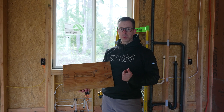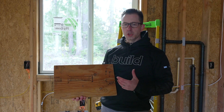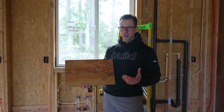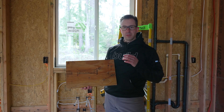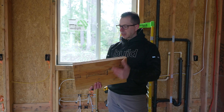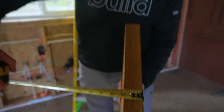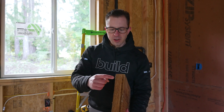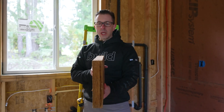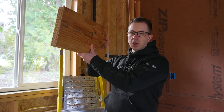Here's a different option and this is what we subscribe to. This is an LVL header — laminated veneer lumber — from Roseburg Company. In the future we'll talk about engineered wood products, but that's what this is: an EWP, engineered wood product. It has been manufactured by a different process and it is very strong and dimensionally stable. It's so strong that instead of being say a 4x8 member, look at how thin this is. If we just run a tape on it, it's about an inch and three quarters. If we look at it down the end grain, you can get a feel for what it really looks like. This is a strong piece of wood, but it's very thin. What we can do with this is actually place it into our header area and maximize our insulation — we'll show you how that works in a second.